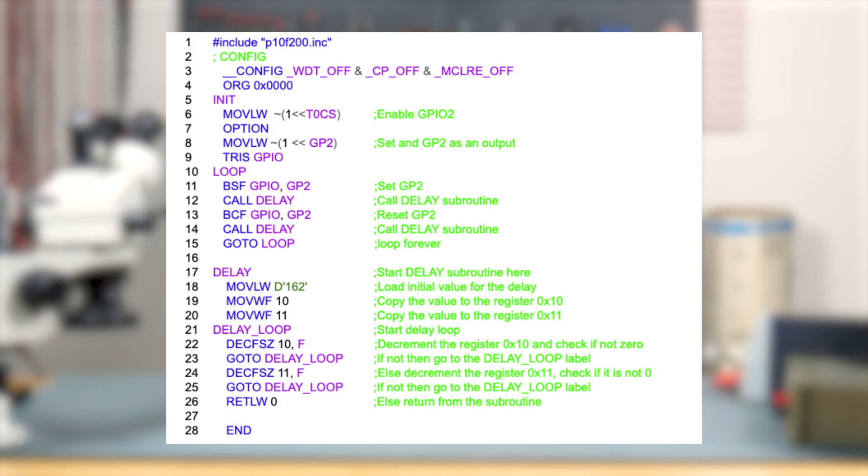As part of the simplicity, we're actually going to do our code in assembly, which can strike fear into some people, but we're going to keep it very simple. One of the benefits of assembly is that not only do you learn at a lower level what's going on — making it a great learning and training tool — but it's actually very efficient. You can save a lot of code space and it runs faster because there's not a lot of extraneous commands put in by other compilers.